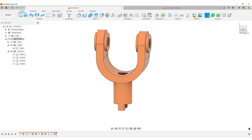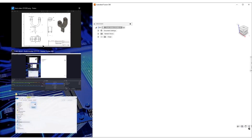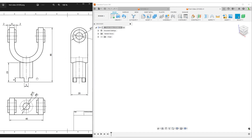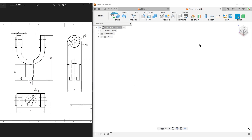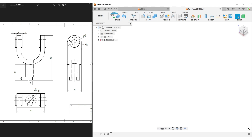If we do it the other way around, we start with 40 and the dimension from here to here is the result of all the steps we make, which can be really hard to edit. That's why on Facebook when you ask a question, the first question you get back is 'what is your design intent?' I'm going to zoom down, open Fusion. I've already saved a new file. This part will most probably be part of a bigger assembly, so I'll create a new component - let's call it 'work'. Components are vital for assemblies - just do it for now, it's a good habit.